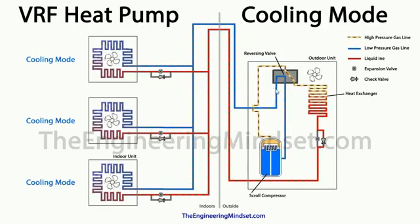Now with the reversing valve, there's only one main inlet anyway, and there are 4 kind of outlets here, and this U-bend here can change position, so it can either channel the flow between these two pipes, or it can shift over and provide it through these two pipes here. The incoming flow from the compressor will either go straight over into the external heat exchanger, or it will divert when this moves over and head directly here to go into the indoor units and the indoor heat exchangers.